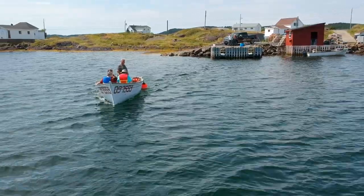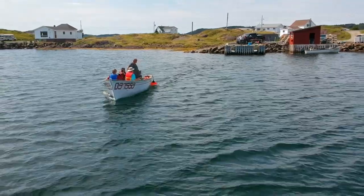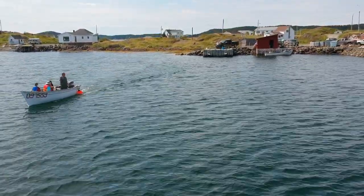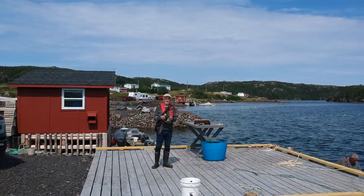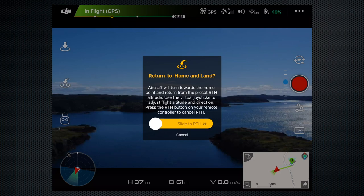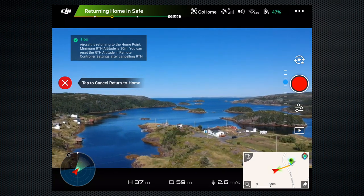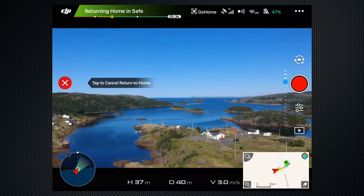There are a variety of autopilot modes. I suggest you get familiar and comfortable with manual flight before using the autopilot, and practice switching back to manual control from auto mode — you may spot obstacles or problems in time to prevent an autopilot accident. The most powerful and useful auto flight is Return to Home, invoked using a key on the remote or a button in the app. The Spark returns at an altitude set in the app, then slowly descends; the camera returns to level and orientation reverts to its takeoff position. In Return to Home, the camera tilt can't be adjusted, so footage is rarely usable.